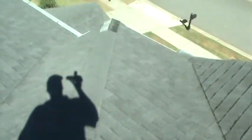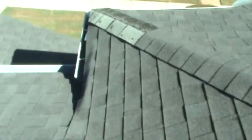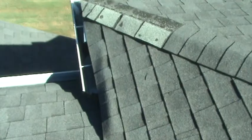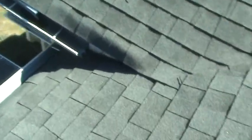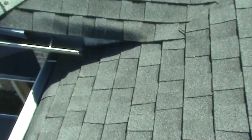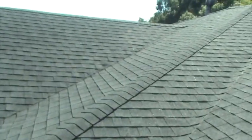And of course, it's got OSB decking under here too. And you see they paid somebody here to come in and repair this section of roof. Lowe's is right down the street, just get yourself some shingles that match and do it right. Nobody wants to do it that way anymore. And then you've got rotted fascia board here, because this little return on the gutters run the water right into it. And then they made some attempt at flashing here. But as you look at the roof line, it's just a shame.